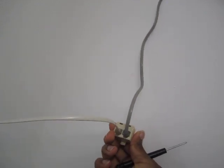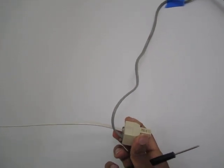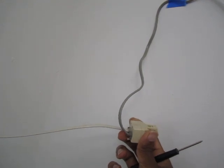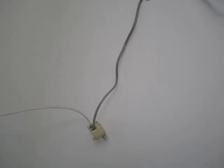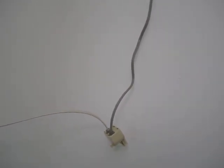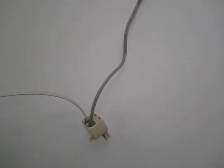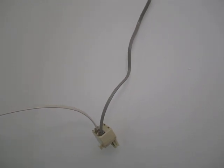Simply connect the 2 cables that you want to couple together to the outputs of the splitter, and leave the input unused, and that will just extend your phone line there. It will also reverse the polarity. So this is a very effective poor man's polarity guard if you need to reverse the polarity for a telephone that is polarity sensitive. In this case, we don't care about polarity because this is not a touch-tone telephone.